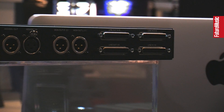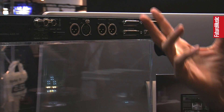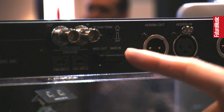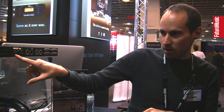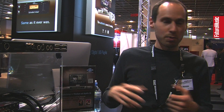Monitor outputs are on XLR — connect directly to your monitor speakers. There's AES/EBU in and out, which is 192k single-wire AES/EBU for connecting to any digital device. One of the biggest questions has been about the MADI ports — on Apollo 16, MADI is used when connecting two units together for mixer aggregation. It sends cues, auxes, and monitors between the two units with only a few samples of latency. Word clock I/O is standard, Firewire 800 with two ports standard, and the same Thunderbolt option bay as on Apollo where you slide in the card for PCIe performance for plug-ins. The external power supply ships with the box and an IEC cable for every region.